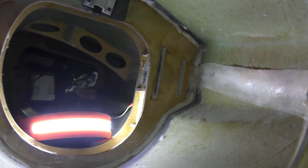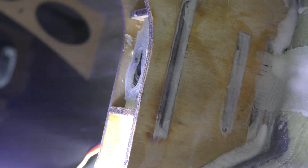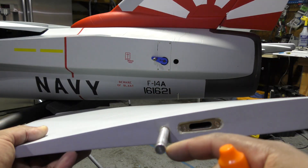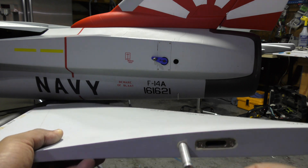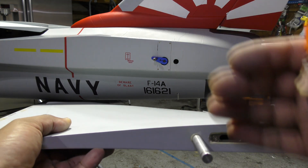That bearing up there as well - when I move this up, there's a bearing in there that I lubed with BVM dry lube. I'm also going to clean this with 1500 grit just a little bit because I can see some blemishes in there, then apply BVM lube and insert it to make sure it comes in and out fairly smoothly.